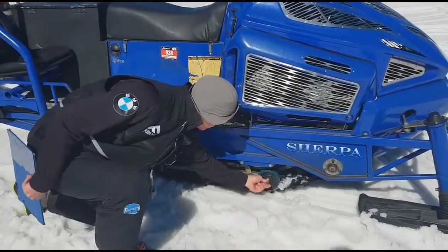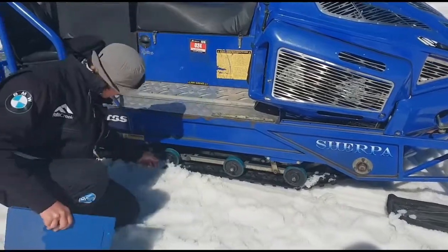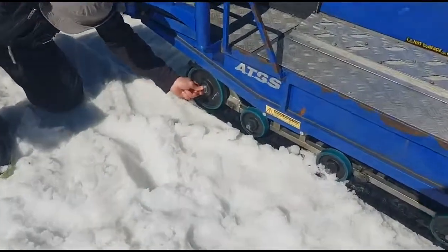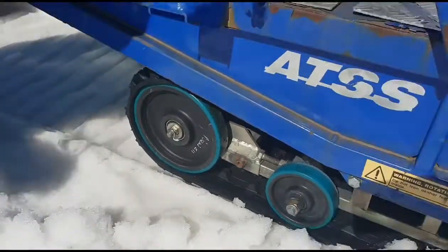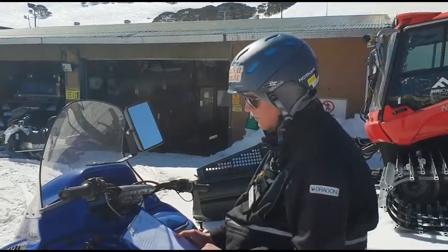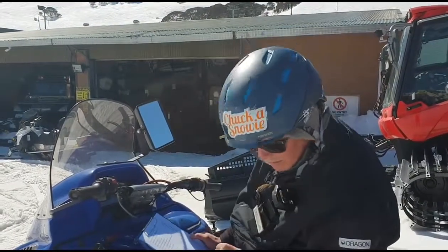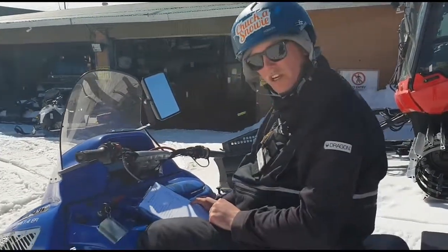While we're doing this, we're also going to have a look at the bolts, make sure they're all still there. We're also going to have a look at this rear axle and make sure that's holding on. Then we're going to do the same for the other side. Now that we've done our tension and rear axle bolt checks, we're just going to have a quick look to make sure there's no dust or debris on here - but generally it's going to be fine.